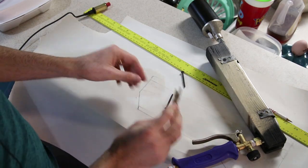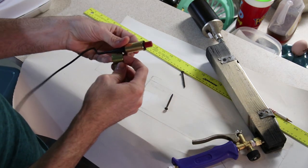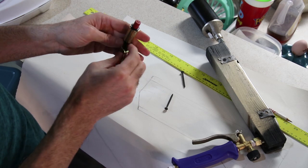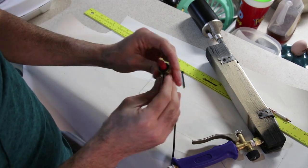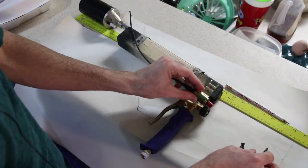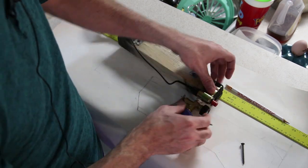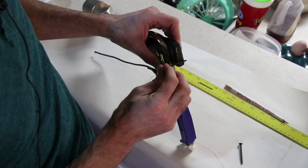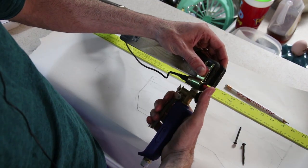Here, I took that bracket that was holding on the little clicker and I flattened it in the vise, put an extra hole on my drill press, sliding it on, and then I will use it to mount this guy in the back right next to the knob. Since I'm right-handed, my thumb tends to be on the left side, so that way I can turn the gas on and then click it while I'm still holding everything together.